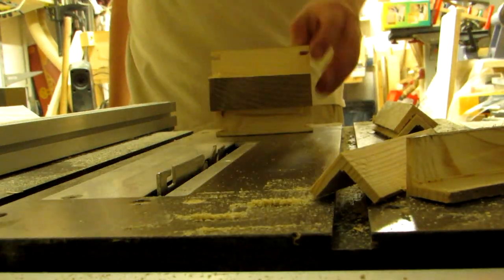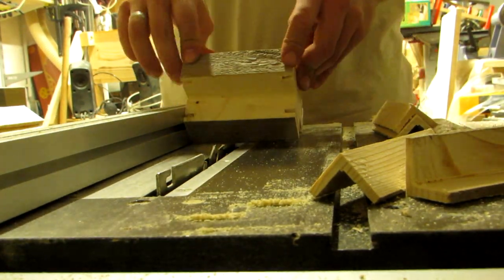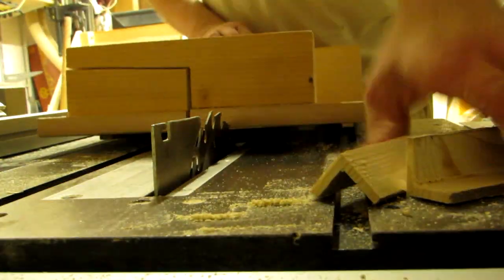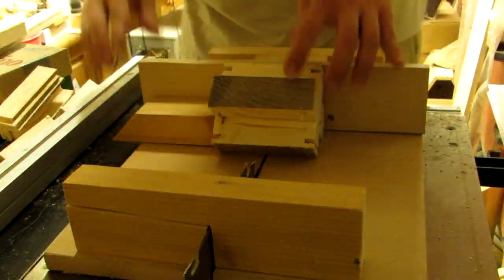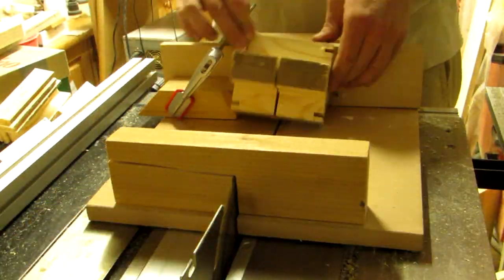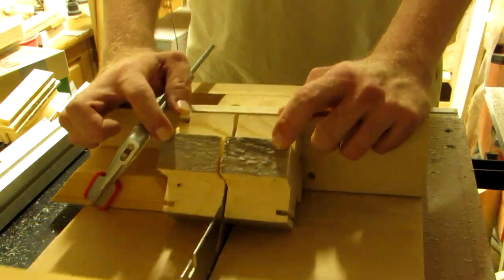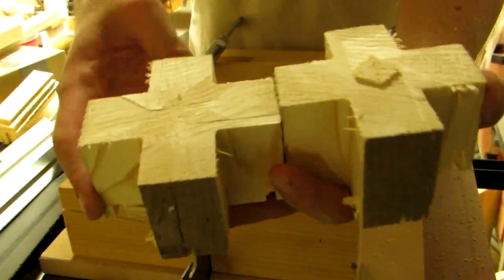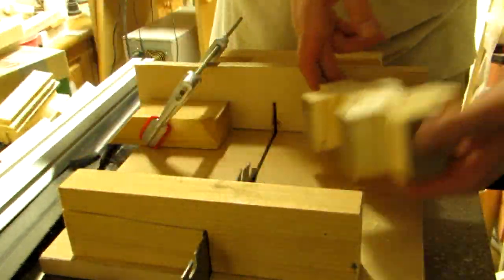Before you can finish the design, you need to cut the scrap piece in half. Because mine was getting tricky to balance on one face, I used my slat and ran it through standing like an axe. I used a stop block to align the cuts from all four sides and finished up with a handsaw. This also added a small design element on top that was completely intentional.